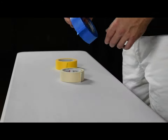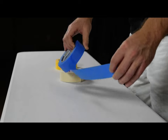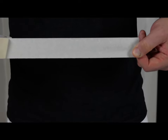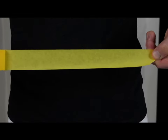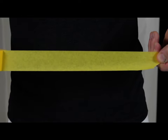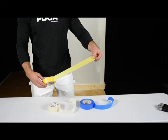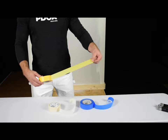Types of tape: blue painter's tape has a 14-day release, so adhesive residue doesn't transfer to the substrate. White utility tape has more adhesion than painter's tape but only has a 3-day release, so don't let it bake in the sun for a week. Specialty tape is job-specific — for example, delicate surface tape is made of very thin rice paper and has lower adhesion, great for painting stripes. Heavy-duty plastic tape is great for exterior concrete or stucco.